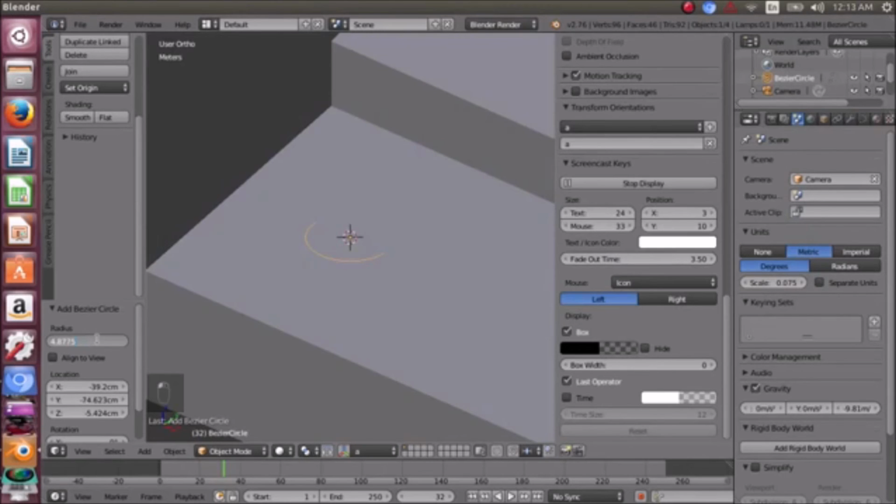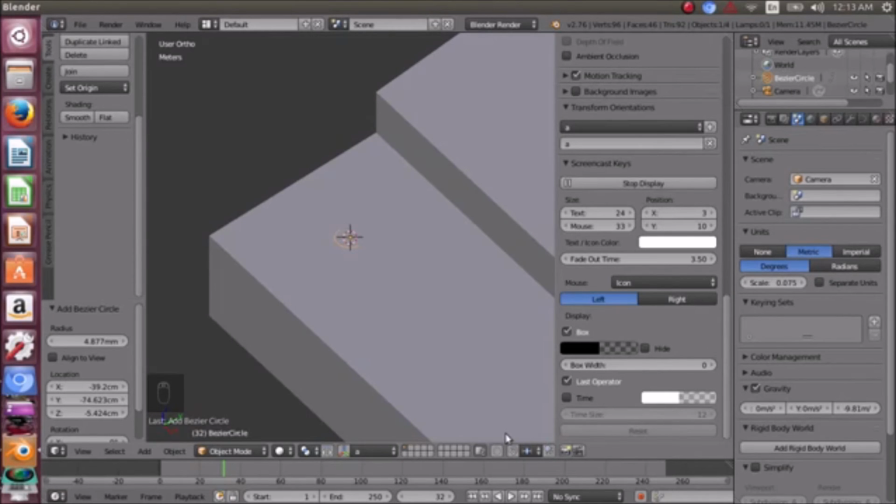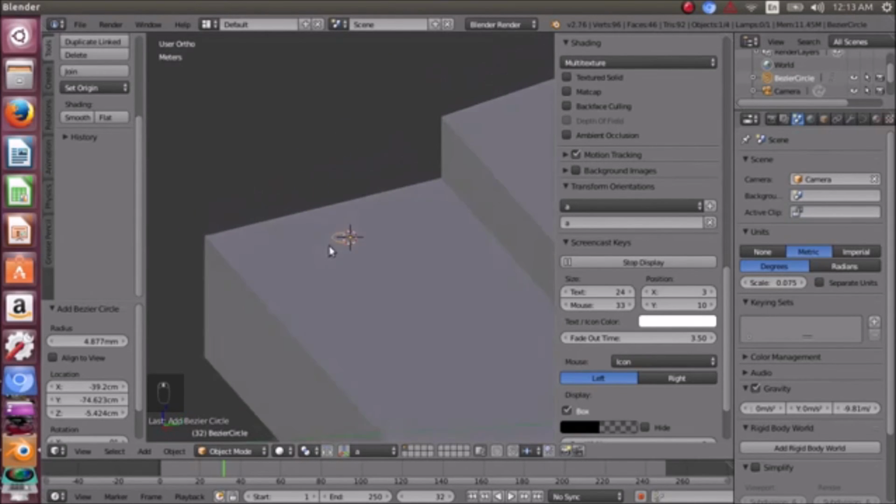Just record that, 4.8775 millimeters. So I'll go ahead and enter that. That looks a little more reasonable. The switch is not going to be that big in any event. It may be good, before you actually design, to get your switches and take some sort of measuring ruler and measure the exact diameter, because sometimes what they list for specs on some of these components is not quite what they actually are. That happens typically with plywood all the time, where you get some tolerance for variance. But in any event, we'll go with 4.877 millimeters.